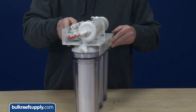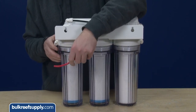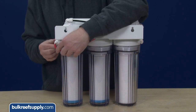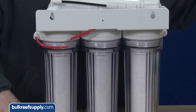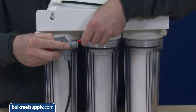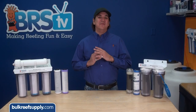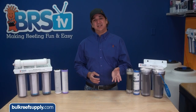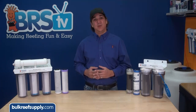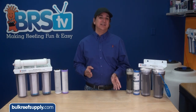If you want, you can also remove the tube from the last carbon block and collect water there, but eventually you will damage the tube over time from removing and reinserting it, which can cause leaks. If you prefer that method or your wastewater line is hard-plumbed, it might be wise to add a three-way valve on the line, which makes collecting a sample really easy. One last note on testing: you will get vastly different results from testing 10 minutes after starting the system versus testing after the system has been running for 10 hours, so you will need to decide whether you want to test at the beginning, middle, or end of each use cycle.